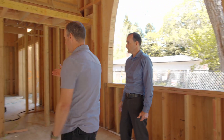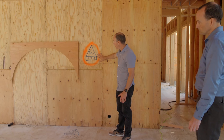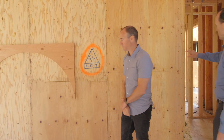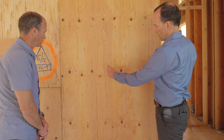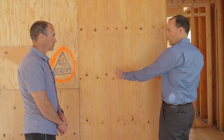We also have other loads — we have horizontal loads from earthquakes and strong winds. For lateral movement and horizontal load, we use a structural shear wall, which consists of studs, plywood, and a certain nailing pattern. Right here, this is representative of what this shear wall contains: it has a length of 12 feet by nine inches, and then we have our nailing schedule, which is six inches on the edges and 12 inches in the field. At the edge of every piece of plywood, we have to have a nail no further than six inches from the next nail. The edge nailing is the first number, and the field nailing inside the four-by-eight sheet of plywood is 12 inches on center.